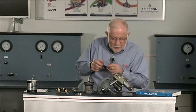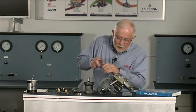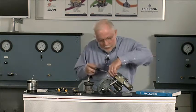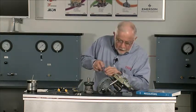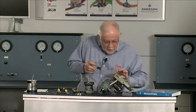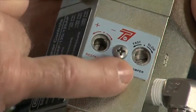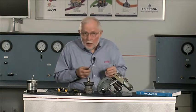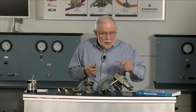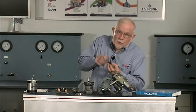The pilot itself is a PRX — it's a double diaphragm pilot, and we're able to take this bottom cap off and check the seat in it without releasing our spring pressure. This is quite an advantage so we don't have to reset the unit when we put it back on the flow line. The double diaphragm makes it balanced so it's extremely accurate. On the side there are two different settings — one is a restrictor and one is a damper. Most elastomeric regulators have a restrictor that allows you to set the gain or accuracy of the unit. With the PRX, you can maintain that high restrictor setting and bring the damper down, which restricts flow from one diaphragm to the other and takes out instabilities, making the regulator extremely stable on low flow conditions.